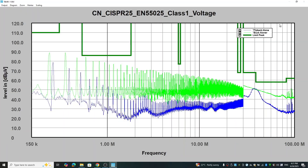We have the buck converter by itself and also the flyback converter by itself. You can probably notice the noise floor has about a 10 dB difference. This is because when testing the buck converter by itself — the green trace — the noise level was quite high, causing an overload. So I had to increase the attenuation by 10 dB, which explains the noise floor shift. But as you can see, the buck converter definitely has a lot more noise compared to the flyback converter. Their switching frequencies are actually pretty close, but given the 9 kHz resolution bandwidth in the lower frequency range, we can still quite easily distinguish the switching frequency between the buck and the flyback.